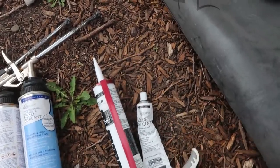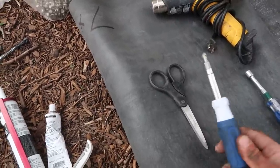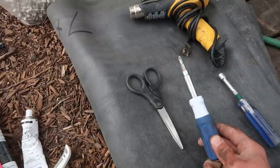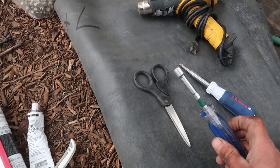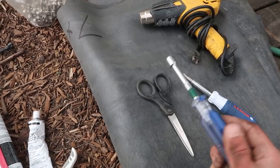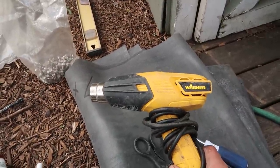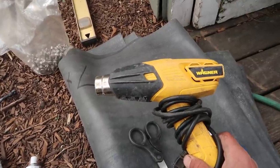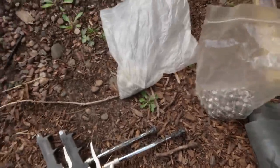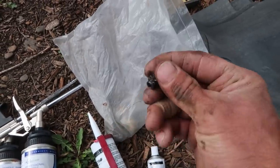You're definitely going to need silicone for this. For hand tools, I will bring a pair of scissors or a razor knife. Today I've got a pair of scissors. I also have a multi-tool screwdriver - this will have your Phillips head, your flathead, that kind of stuff in there - and then a 3/8 nut driver, which really helps for screwing the hardware into the grommets on the Bio Falls. I also have a heat gun in case I need to dry the face of the Bio Falls or the back side of the liner after cleaning it, to get a nice clean surface ready for reattachment.